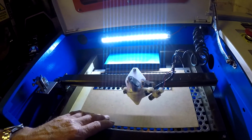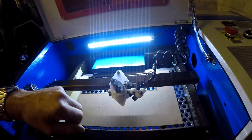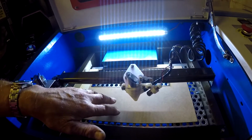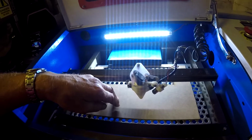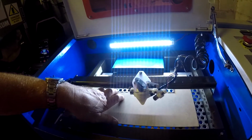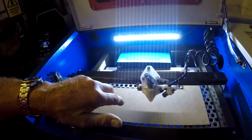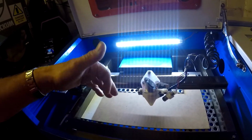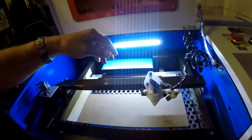So I told him, take the air assist nozzle off. I sent him another one. He lined the lasers up as it described on YouTube, put the air assist nozzle on, connected it up, and bingo, it worked perfect. And then he realised what the panic was. I can imagine him setting that on fire for his first cut, plus the power settings were up at nearly maximum. But it's not the first person that's had a mishap with it, like I did. You learn by your mistakes, but with this you don't want to make mistakes. You want to progress with cutting and engraving safely. It's not brain surgery, but it soon catches you out.